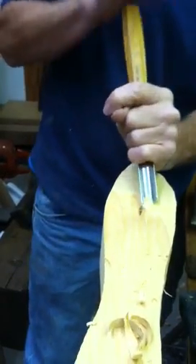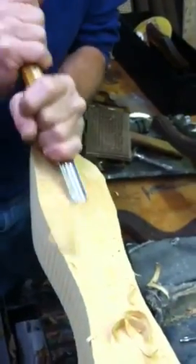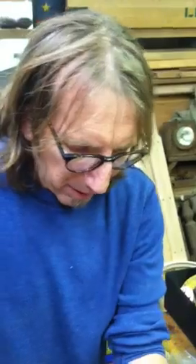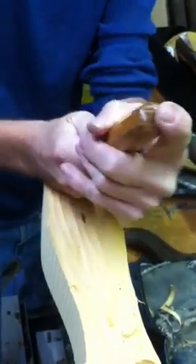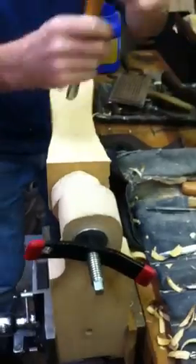How often do you have to sharpen them? It depends. Doing carousel carving all day, if I'm using the same three tools for most of the day, we sharpen differently in an industrial setting because we have to sharpen so much and fast. It's not unusual to buff the edge back out maybe three times a day and sharpen it every four days or so. It really depends — like here I hit that knot. If you have a lot of knots you're going to lose your edge quicker, and if you get a nick from a knot or glue it'll leave a big streak in what you're doing.